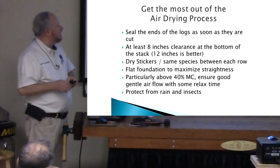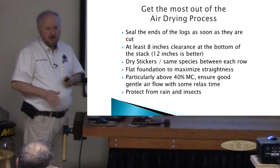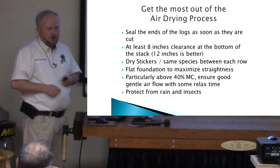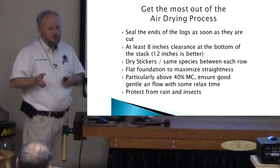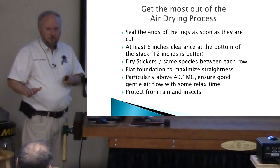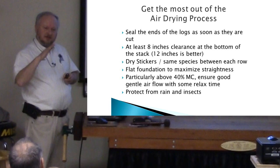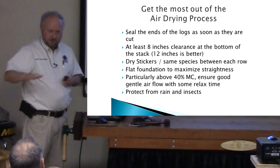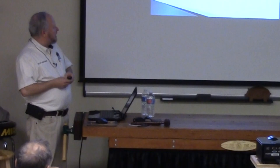When you make a stack, you really need at least eight inches above the ground before you start to stack — 12 inches is better. We've always just used one row of concrete blocks, which is eight inches, and that works fine. You've got to have dry stickers between them. If you use the same species of wood you can use stickers that the mill cuts, but it does sometimes create a molding problem. You want to start with a flat base so you don't program in a bow. Pull strings on the corners, put all your supports at the same height and plane.